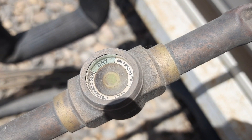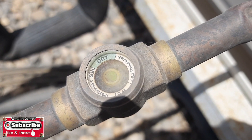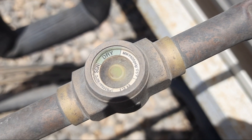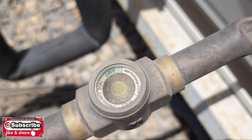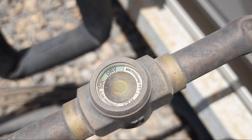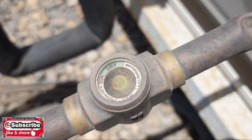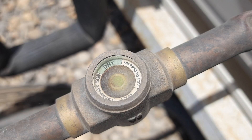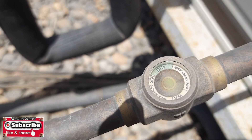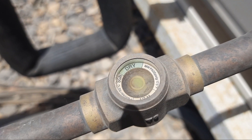Today I'll tell you about the practical experience of bubbles in the sight glass and the relationship between those bubbles and freon charging. We can see how the bubbles will disappear from this system. The system is not completely charged right now — freon is low, which is why it shows bubbles. The refrigerant we are using is R134.